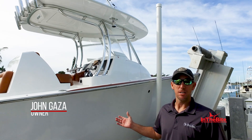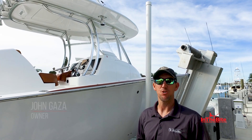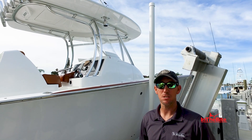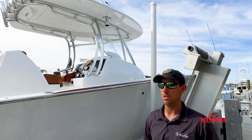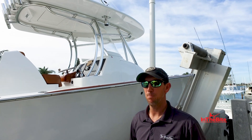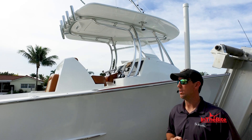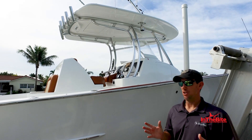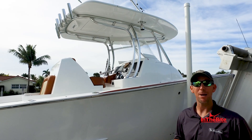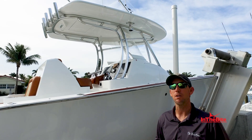One of the design features that was paramount on this boat was to design a very clean, efficient boat — less is more. We use all Pro-Set epoxies; the entire hull is infused and becomes one composite component. The entire boat gets post-cured at 180 degrees in an oven. We finish the entire boat — all the parts are painted. There's no gel coat in the boat. This is truly a custom quality vessel.